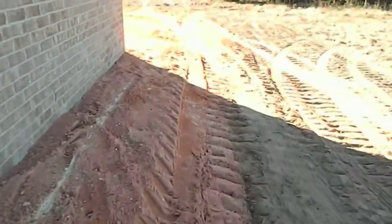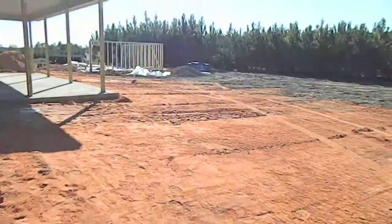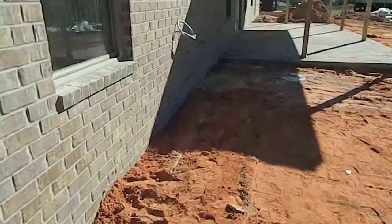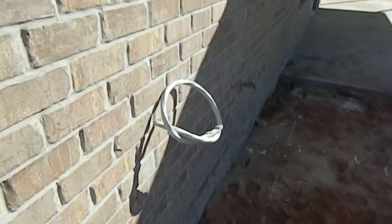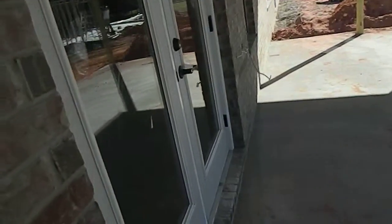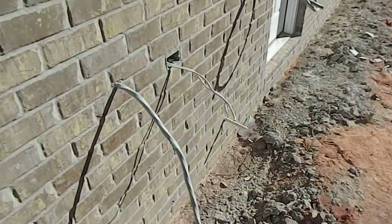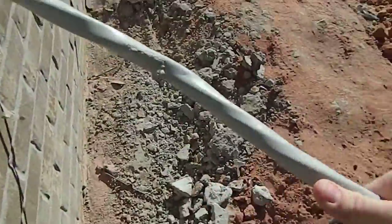As we walk around, it looks like they've done great on the lot. We've got an electrical panel here, which I believe will be for your pool. We've got a spigot located here. This is where your two fans will be located. This is your double French doors. Another electrical connection located here. This looks like it's going to be for your AC or your generator plug-in, one of these two — not sure which one will be which, but that's what these two connections are for.